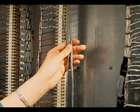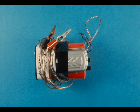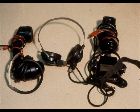These are the two wire cables that connect the IJB to the transmitter and transducer. How can you identify them? You cannot identify them by sight — they are identical. The use of a buzzer or a bell powered by a one-and-a-half-volt dry cell is the recommended way to identify wire pairs.